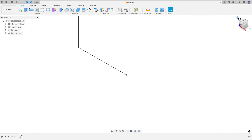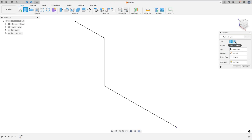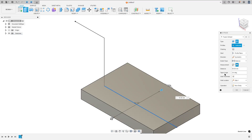Finish the sketch. We need to make the extrusion here — the base. This area here has 64mm and the thickness is 12mm. So go to extrude, the type select thin extrude, remove the chaining here, select this line, the direction select symmetric, measurement hole length and the distance 64mm, and the wall thickness select 12mm.